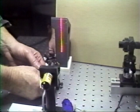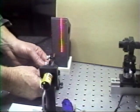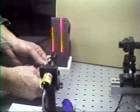A diffraction grating is seen here in profile, 7 centimeters from a target surface, which is an eighth-of-an-inch stair step. Here's the zero order, or triangulation image. If the grating is rotated, then the zero order — which is a mirror reflection — is moved out of the way, and the holographic magnification image comes into view. It's magnified over the triangulation image by about 10 to 1 and is telecentric.